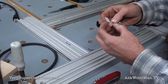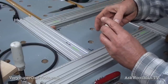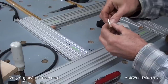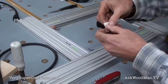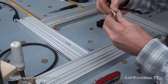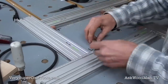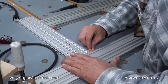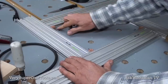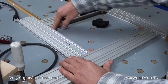The way I'm doing this — just so it's not going to get flung away when I'm routing — I'm just putting a piece of tape on that little tenon and then backing it in the other direction. That's sticking out too much, so I'll just cut that off and stick it into the corner and keep my eye out to make sure I'm not going to wing it off. That's going to just keep the router from cutting all the way to that corner.